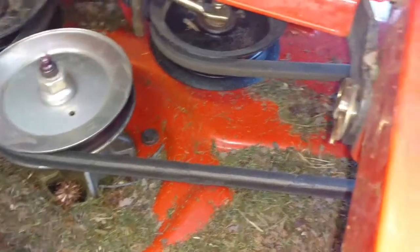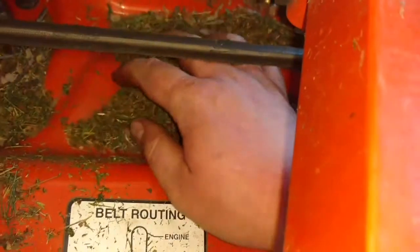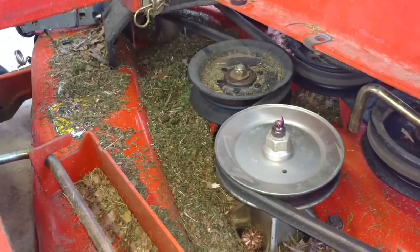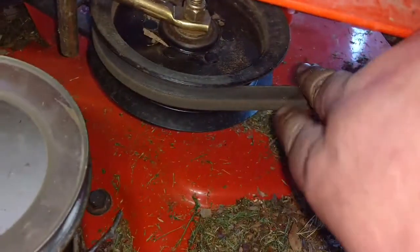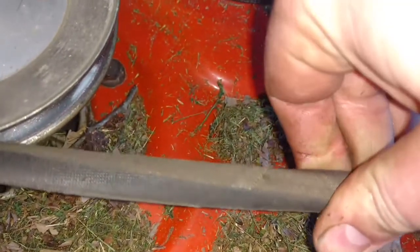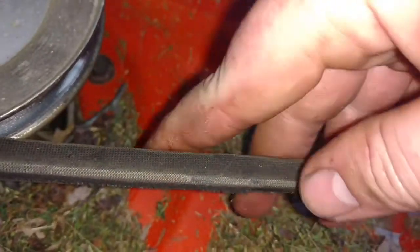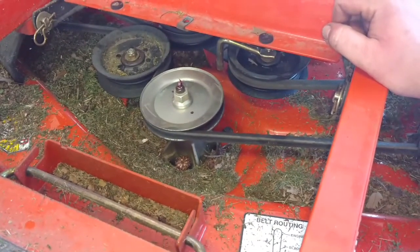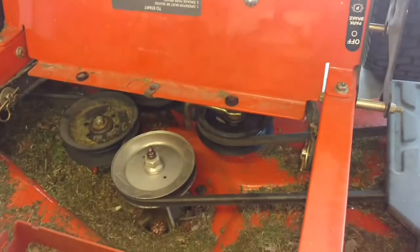At this point, if you have the cover off, you can also take these covers off and scrape any debris. I cut grass yesterday so this is leftover from that. Another thing you want to do is inspect your belts and any pulleys, and make sure there's no cracks, splitting, or dry rot on any of these belts. This actually looks really good — I have no concern for this belt. Also do the same thing on the pump drive belt that drives the wheels. It's a little more difficult to get to, but you can lay on your back on the back side and be able to inspect it.